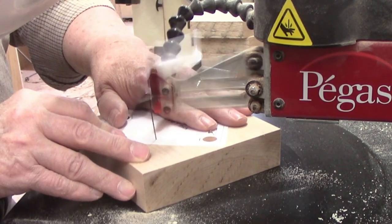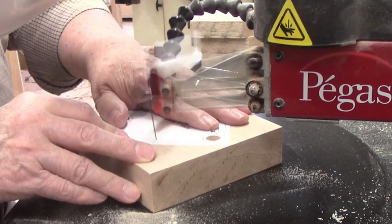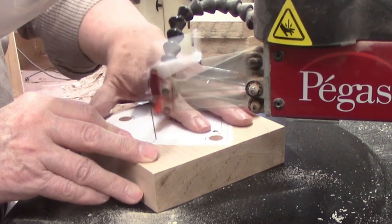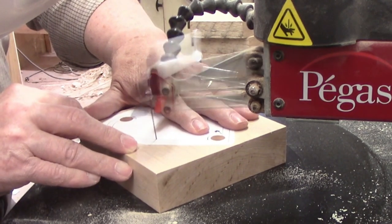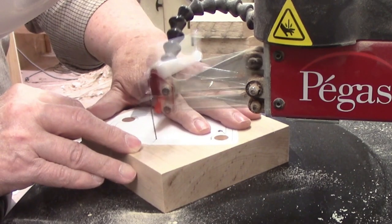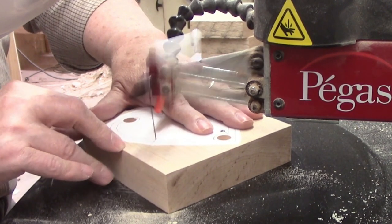I measured the magnets and they are 1/2 inch in diameter and 3/16 deep. They will fit easily in the base and fit with just a little to spare in the top, so I drilled 1/2 inch holes in the base and top for magnets instead of 1/4 inch holes for dowel rod. I used a Forstner bit to carefully make the holes just deep enough that the magnets were flush with the